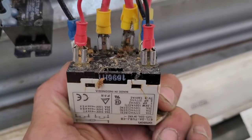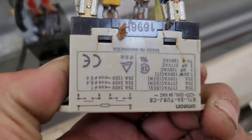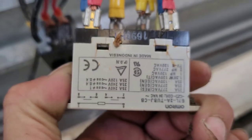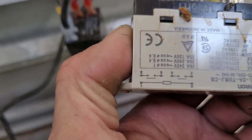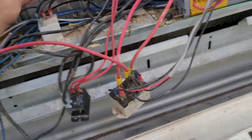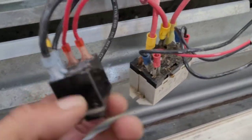When the switch is not energized, power does not go across these four wires. When it is energized, six and eight become a closed circuit, and two and four become a closed circuit. When it's not energized, the circuits are open. The inputs come into terminals eight and four — you can see I've got one of them pulled — and they give power to terminals six and two, which go that way and provide 240 volts to terminals one and four, and also to this little relay.